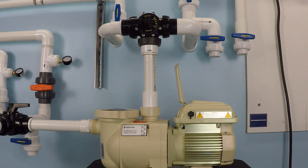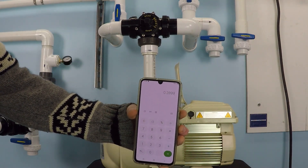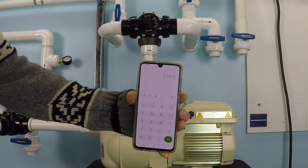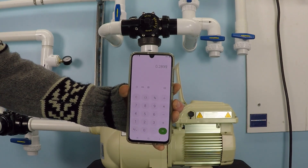To make that number more useful, we can consider that it was 2.23 kilowatt hours and the nationwide average for electrical costs is 13 cents per kilowatt hour. So 2.23 times 13 cents — the answer to your question, how much does it cost to run a pool pump for one hour on average, would be about 29 cents.